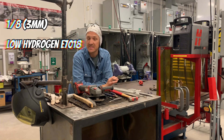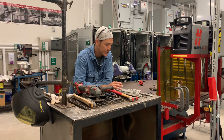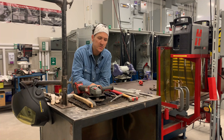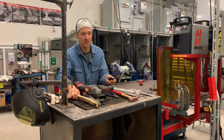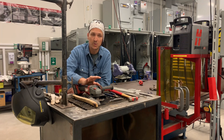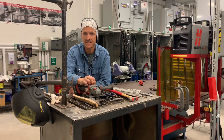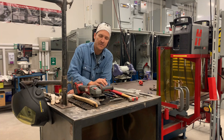As always, I'm using a low-hydrogen 7018 electrode from the rod oven — I've got an eighth of an inch in diameter. The standard tells me it has to be an eighth of an inch or greater; we choose an eighth of an inch. Remember, on every single pass you want to use a fresh rod. Two of the most important tools are your chipping hammer and wire brush. I also have an angle grinder to remove any residual, but remember — no metal-removing tools are allowed, no abrasive discs, saw blades, or anything like that.